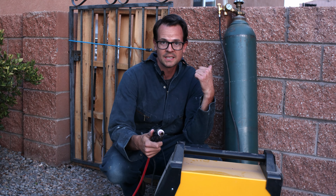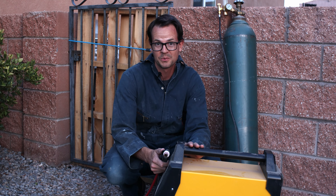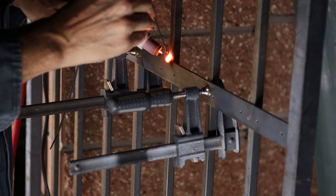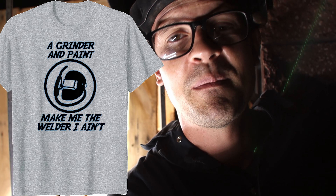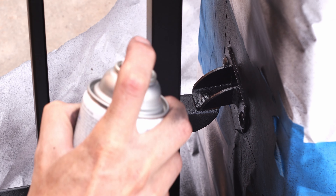I'm gonna weld those bars into place. I have my Alpha TIG welder — I'm not sponsoring anything, but I really like this welder; I have a link down in the description if you're interested. I'm just going to use the finger switch with the TIG and weld those bars into place. The welding went pretty good — I got the top, middle, and bottom all done. It took me longer than I was expecting so it's pretty late; I had to bring out some lights. Tomorrow I'll grind it down — a grinder and paint make me the welder I ain't. I finished the welding last night, touched it up with the grinder, spray painted it black, and now I'm done with the metal portion of the gate.